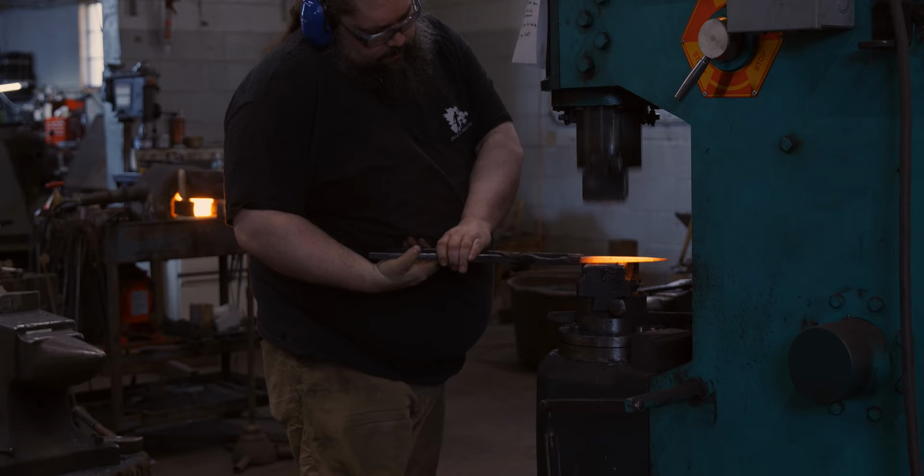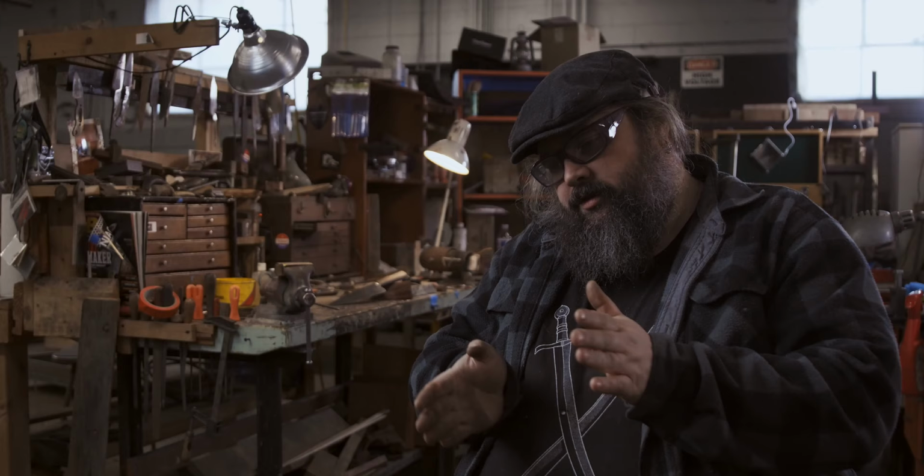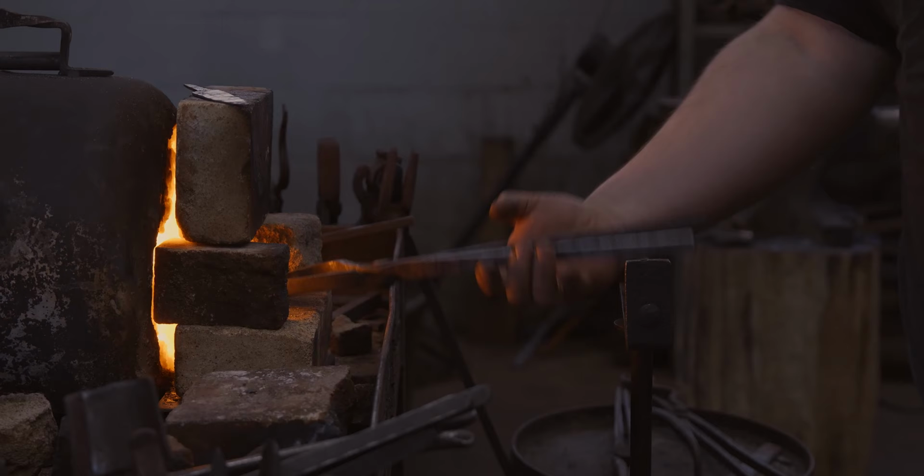As I start to pull the heel out, that heel gets wider, but it also gets longer on one edge, so it'll curl the tip up. So I pre-curve the tip down to help keep it centered.